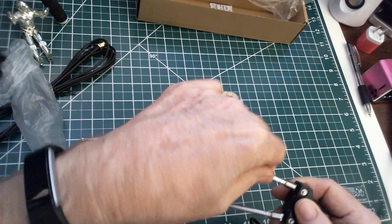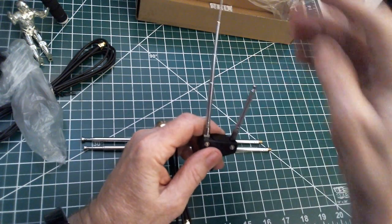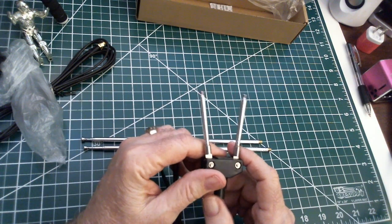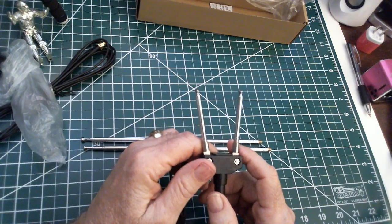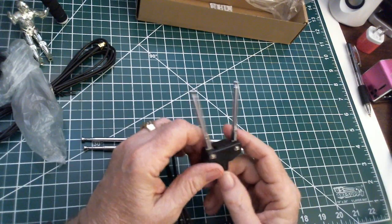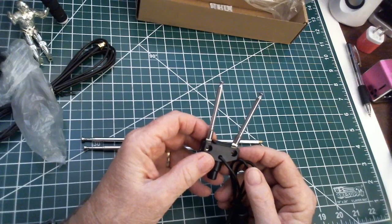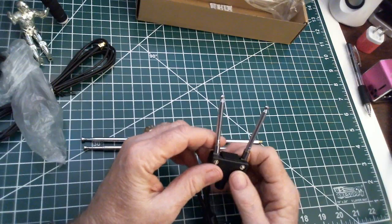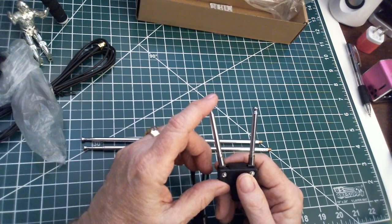Naturally, the higher the frequency you want to listen to, the shorter the dipole. So you could even get way down to here, pretty short, which, for instance, would probably be in the range of monitoring those transceivers that are on aircraft, because they're way up there at a gigahertz, I believe. So that's what I think. I will try it, because I don't have a good antenna for monitoring those transceivers or transmitters on those aircraft. All my antennas are too long.